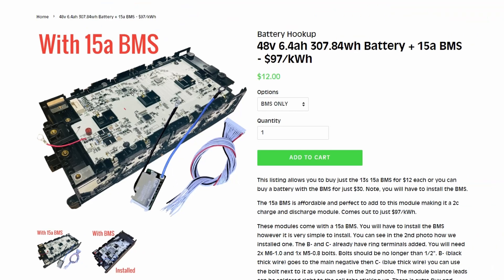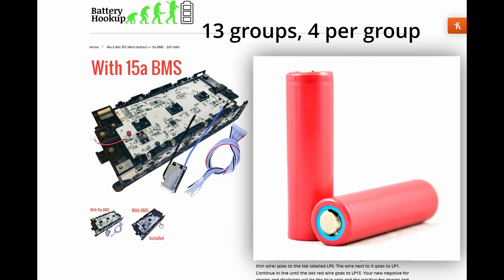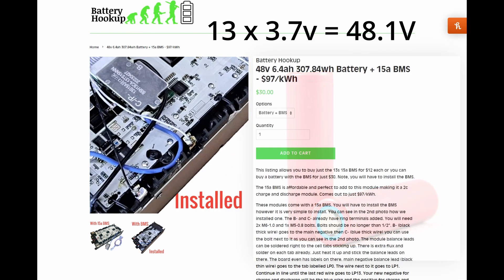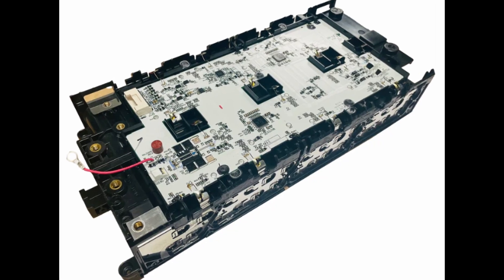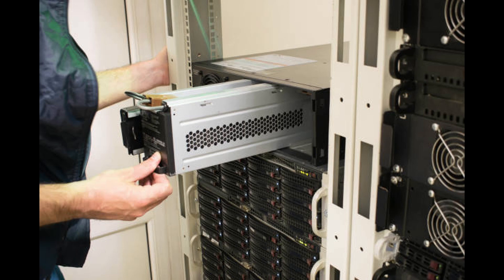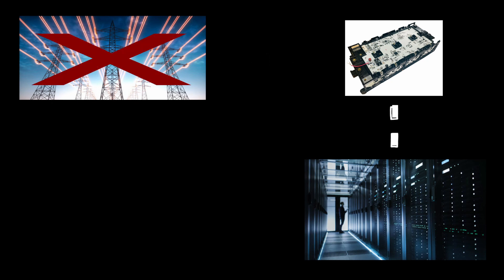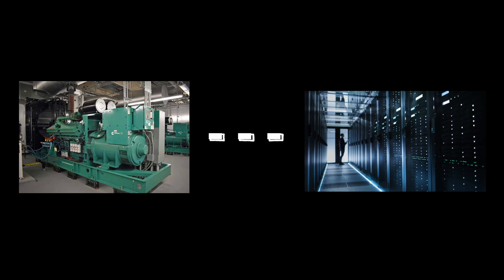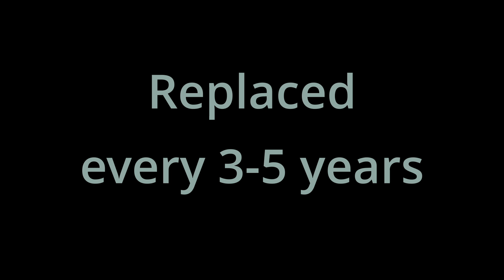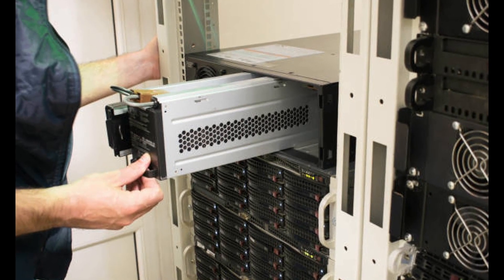Allow me to introduce you to this particular offering. What makes these compelling is, one, they're extremely inexpensive per watt hour — much less expensive than something you'd find on Amazon — and two, the cells are configured with 13 groups of four cells in series. At 3.7 volts per cell, this adds up to a very friendly 48 volts, so you can use them as-is with a wide range of electronics. These packs were used as temporary battery backups for servers — keeping servers online just long enough for gas generators to fire up. Data centers replace batteries every three to five years, so these packs were likely cycled fewer than 50 to 100 times and still have many years of prime performance left.